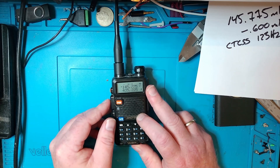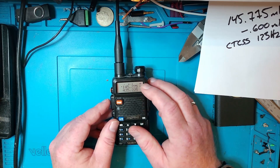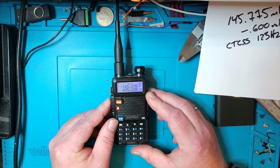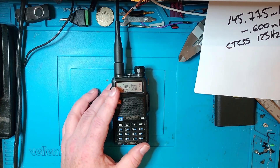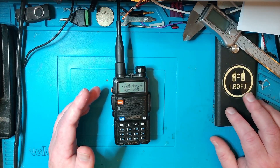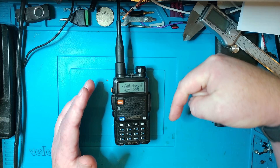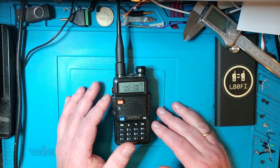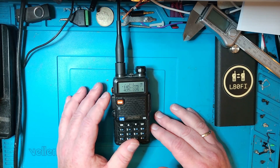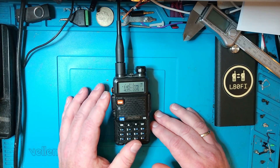We have 145.775 as you can see in the top VFO, programmed to memory 127. When I press through the memories you can see the frequency changes to 145.775. And that's how you program a Baofeng from the front panel. I'm Morten LB0FOX India — if you liked this video please hit the thumbs up, leave a comment below, and there are ways to support the channel down there if you can afford it. Also remember the European Ham Radio Show every Sunday at 2:00 Central European Time on youtube.com at HamShowEU. Thank you for watching, see you down the bands — 73!